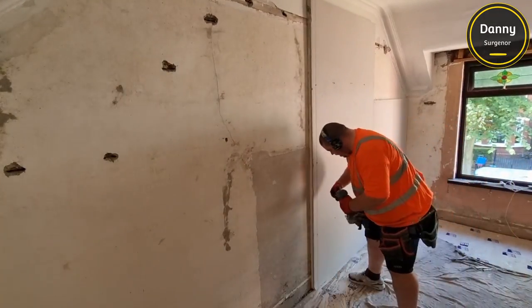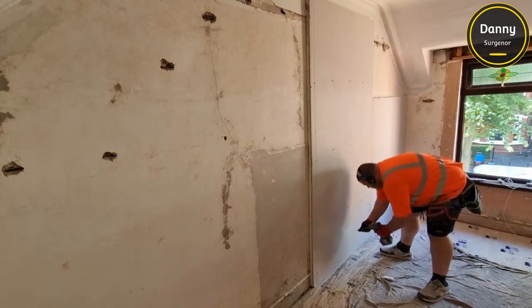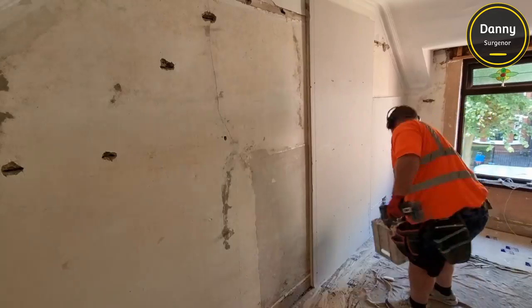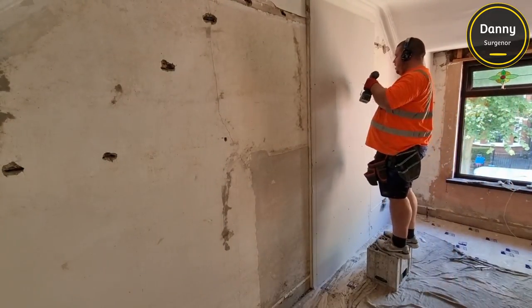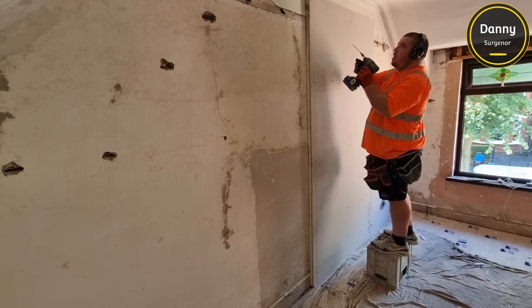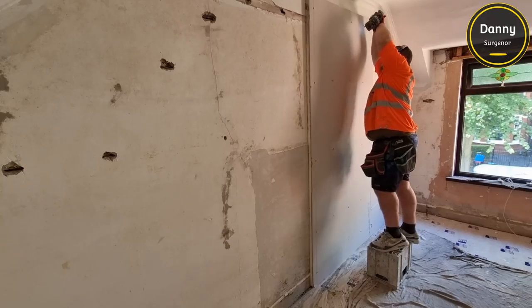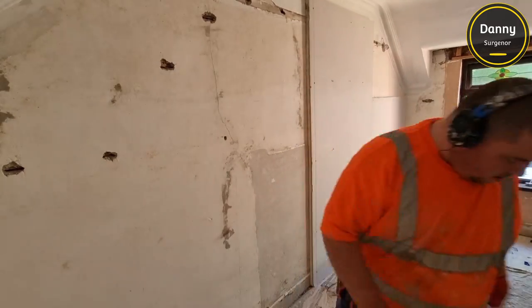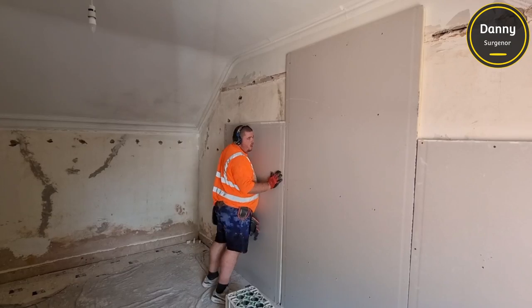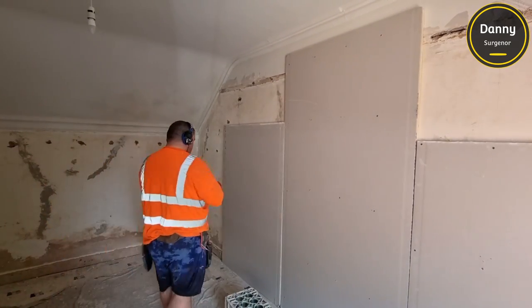When you're going to price these insulated plasterboard jobs up, you need to check what your substrate is. You can see here there are holes all across this wall - some of them were just damage from whoever was here before us. When we come, we tap it with a hammer. If it's solid wall, then happy days.